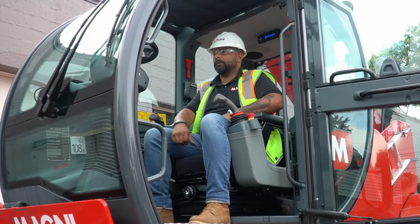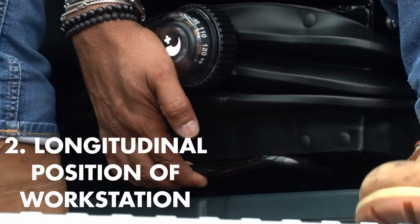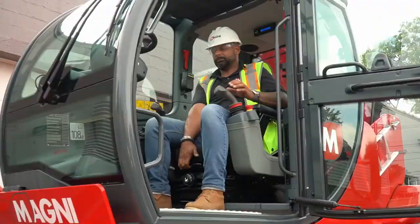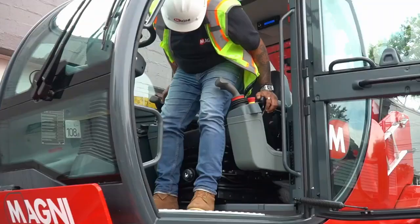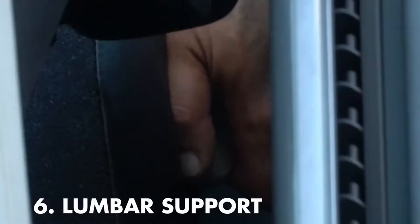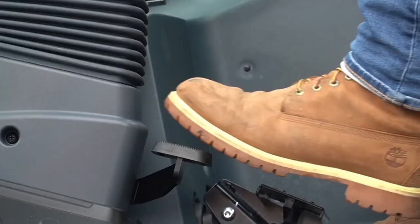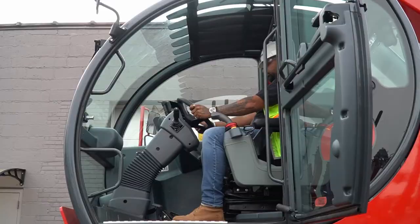Next, adjust the longitudinal position of the workstation by lifting the lower bar so you can comfortably work the pedals. Next, adjust the longitudinal position of the seat only by lifting the upper bar — adjust so you can grip the joystick without shifting your elbows with your arms relaxed on the armrests. Next, adjust the seat height by pulling or pushing on the white handle — the goal is to have your knees at right angles when your feet are resting on the floor. Using the handle on the right side of the backrest, push down to adjust the tilt. Lastly, adjust the lumbar support by turning the knob on the left side of the backrest, where there are three positions available. Once seat adjustment is complete, adjust the steering column by depressing the foot pedal to the left of the brake pedal, then adjust the telescopic position of the steering wheel by unlocking the lever on the right side of the steering column.